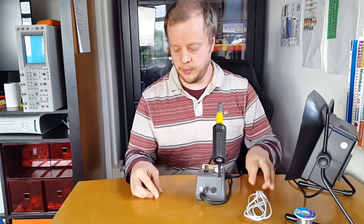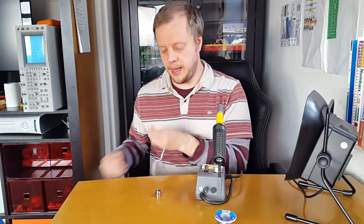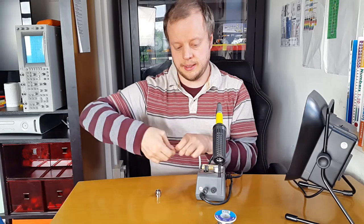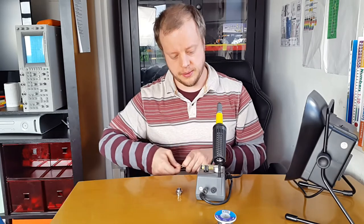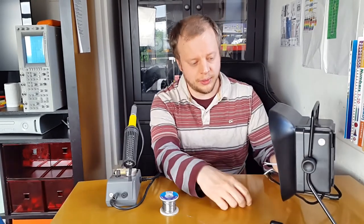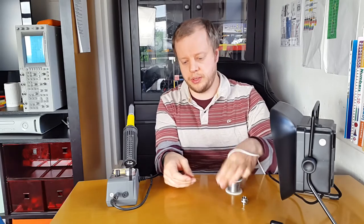I'm going to probably need to do two things with this particular bit of cable - I've bared this end of it. I'll just twist it up because it's a bit of a mess. So I'm going to need to tin this, and then I'm going to need to get it into some solder cups. I hate solder cups - I'd always prefer crimpable connections. I couldn't find this in the local Maplin with anything but these solder cups. So we'll just wait for my soldering iron to heat up. This is flux core solder - I suspect we want to get the extractor as close as we can to the job so I'm not inhaling the fumes.